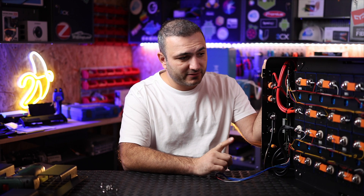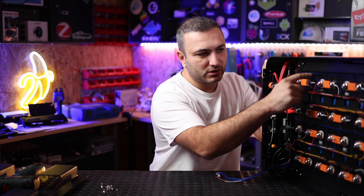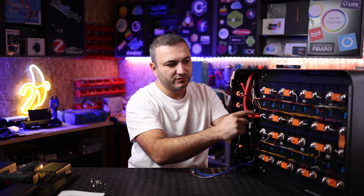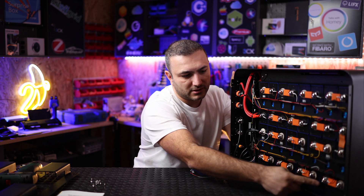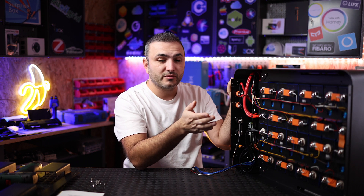The cells inside are lithium iron phosphate and individual. As you can see, we have 8 on the top — they are connected together, alternating positive and negative, daisy-chained. They are also connected with another 8 on the bottom, giving us 16 cells total — so it's a 16S battery pack. This is very good and can work with many brands of inverter.